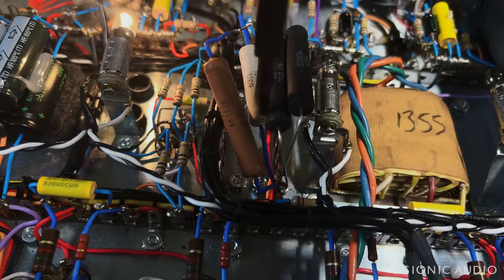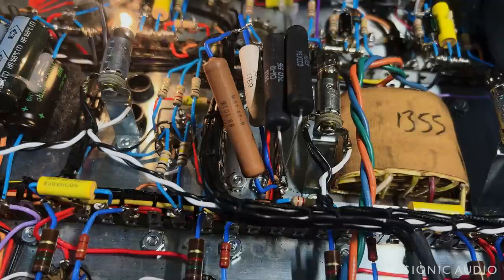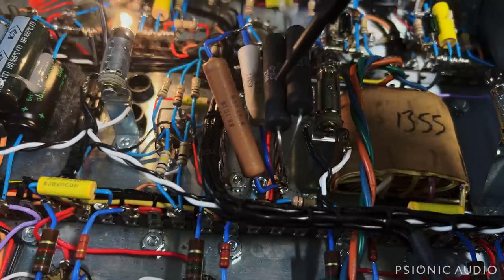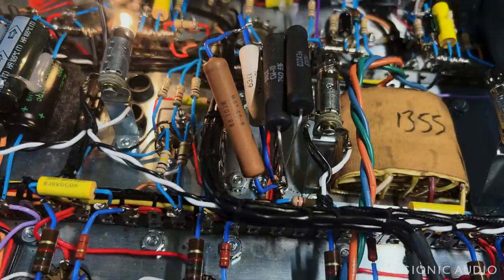The issue is this one here, which goes in series. Going from 68 to 75 moved the low power bias in the right direction, but we're not there yet. So this resistor goes back to stock, but the series resistor needs to go up in value — but not a lot. The problem is that large wattage resistors come in stepped values. It's not like I can say I need a 78.5 — that's perfect, the math says that. I've got to go with what's available: 75 ohms, 82 ohms, et cetera.